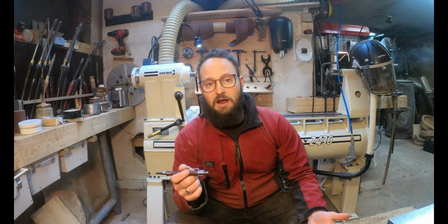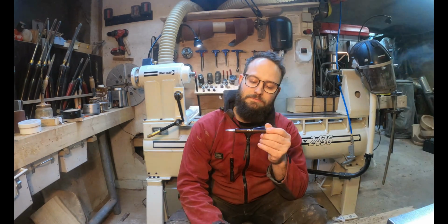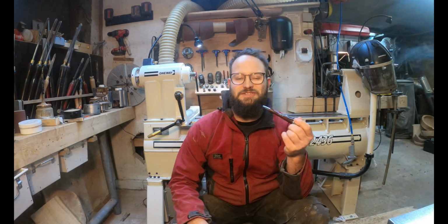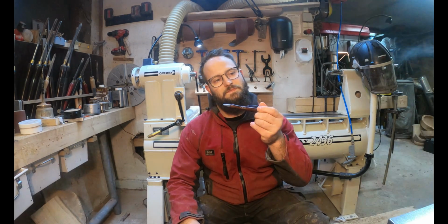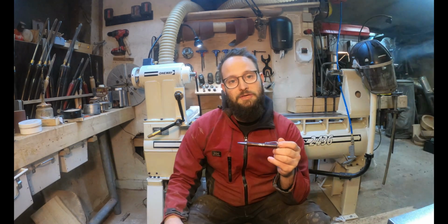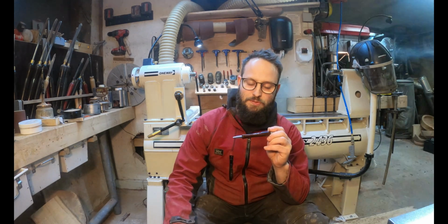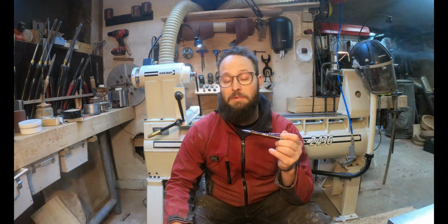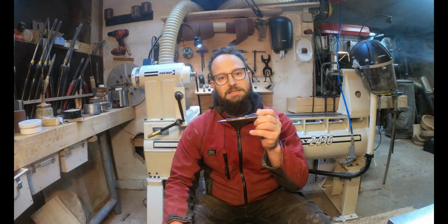And at the point I was making a lot of pens for a lot of people, and some people asked for a bit extra. So I thought to myself, well, there has to be something I can do instead of just engraving the names on it. It's going to be black. So I put two and two together and thought of using the deep engraving with the Eleksmaker, like I showed you, and just putting some metal powder in it. You can use any powder you want, or like Milliput or whatever. Just put it in there and sand it down.